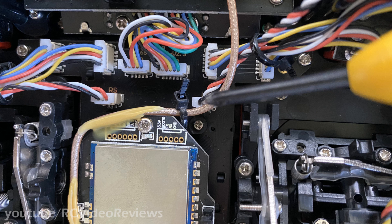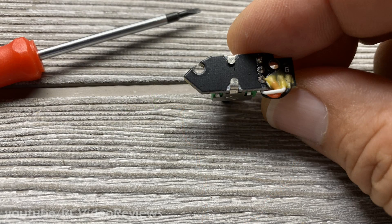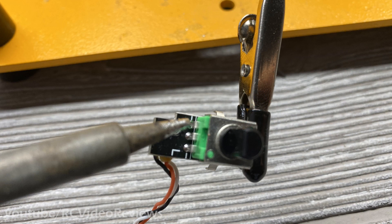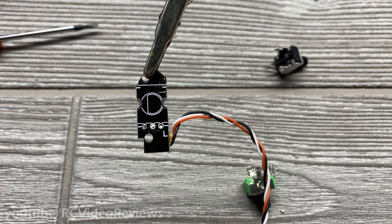Red is on the right-hand side for both potentiometers. Now both potentiometers are out — time to go over to the bench. You'll notice that both potentiometers have a metal tang that wraps around the PCB. All you need to do is lift that tang up and the potentiometer is free to desolder from the board. These are the three pins that need to be desoldered. The easiest way is to start on the bottom, lay your iron across all three pins, and rock the pot back and forth until it becomes loose, then hit each pin until it lets go.